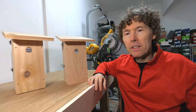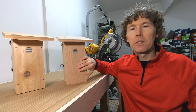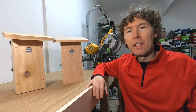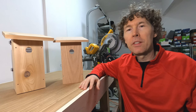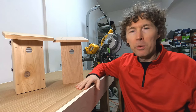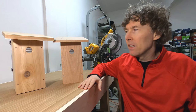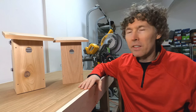About the wood I use: I typically use red oak, which is nice, flat, and comes in the right dimensions. I've also used cedar one-by-six, which in my case is a cheaper choice and cedar also lasts well in the weather. However, it was a little more warped and cupped, so the birdhouse isn't quite as square and straight — but that doesn't matter so much for a birdhouse. These are two pretty much identical birdhouses I built — one out of cedar and one out of oak.